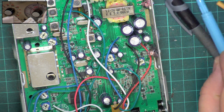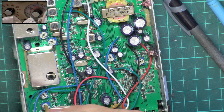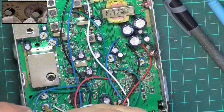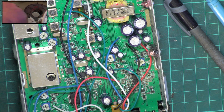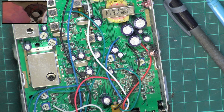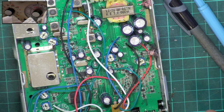So is our mystery preset down here the squelch? Yeah. Excellent. There we are. We're coming in at 100 microvolts and going out at 30, but that's fine. Well, I'm pleased. So we found out what every preset does in the radio. Well, that's a turn up for the books.